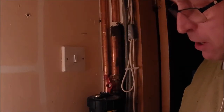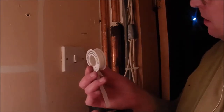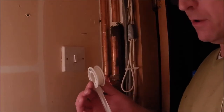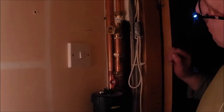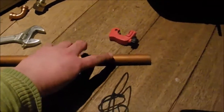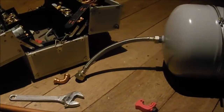Apologies for the camera angle changing quite a lot — we're really stuck in this little corner of the house. This is PTFE tape, and we'll just put some around there and around there. That just helps the fit and seal. Right guys, we've got our little nut on there plus the ring, same at the top with PTFE. We are on — this is coming on quite nicely though it's taking me a little while. We'll make up this fitting section here so when we fit it in place, all we have to do is tighten up and we're done. We've got an old bit of 22mm pipe here, I'll cut a little bit off and onto that part. We'll PTFE tape again and get it all to fit.